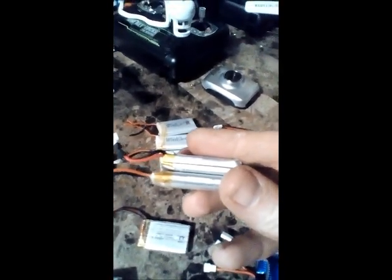These ones here are 3.7V 500 mAh — that's generally what's found in the Strikers. The top four here are aftermarket ones I purchased, also 500 mAh 3.7V. This lower one is out of a stock quadcopter. These ones here are 650 mAh, also 3.7V, and these ones are 800 mAh, also 3.7V. If you take a side-by-side comparison to the 500, you can see the 800 is considerably thicker. The higher the mAh, the longer it takes to discharge.